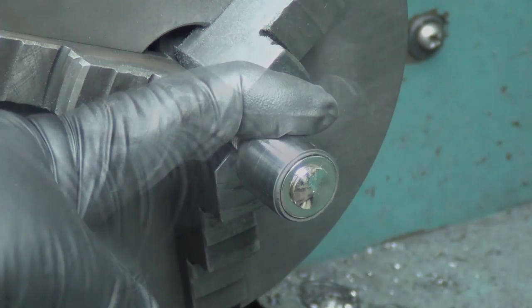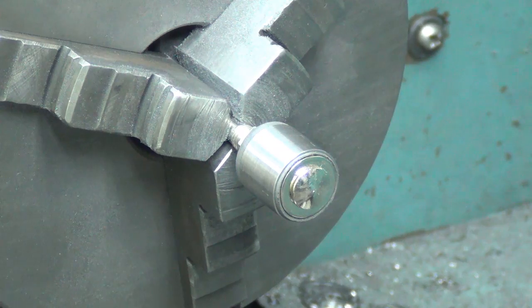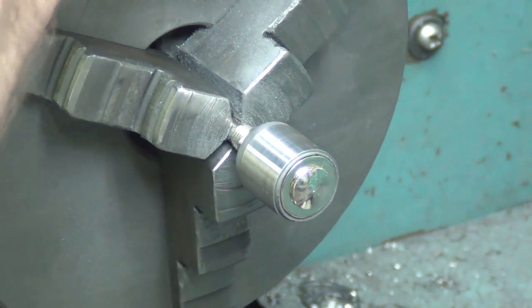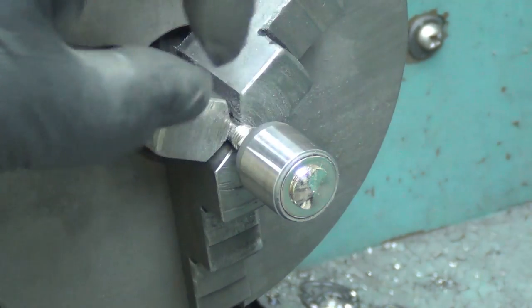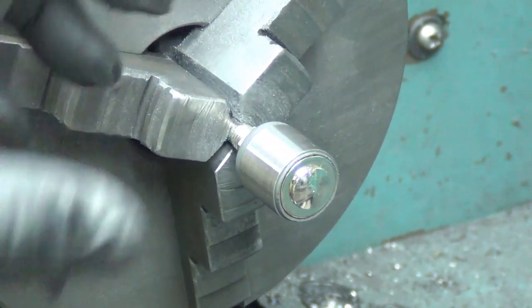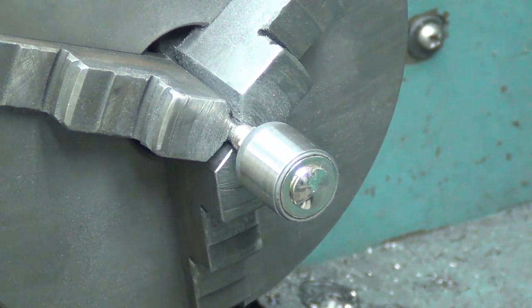That's not very concentric but I'm just taking the outside down a tiny bit, doing it with sandpaper. I should be able to maintain even enough consistency that way. I'll probably turn it down a little bit on speed, because if you spin too fast every time it goes out you can hop over it instead of staying right on it.